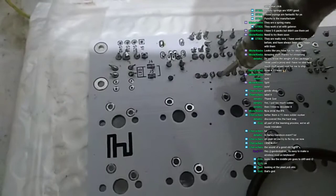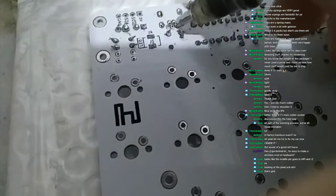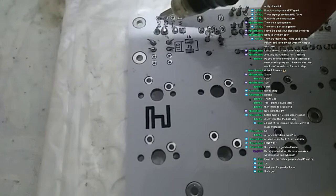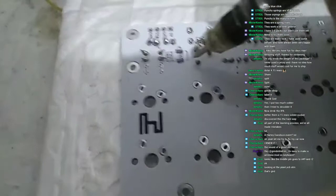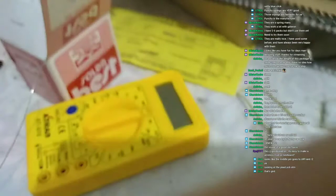That's GND. Oh, okay. So that's GND. Yeah, that's why the whole pad is busted, see? Because it's connected to the copper plane. Hmm. Okay, what's the nearest GND pad? It's here, right? Okay, so I will jump that one to this guy here, and that should work nicely. See? So I will jump this pin that's busted to this GND here, which is the I2C, I believe, GND, and it should work. So that's what we are going to do.